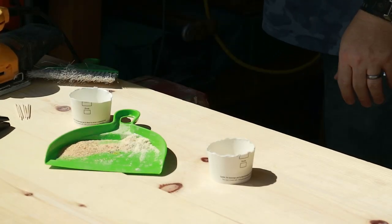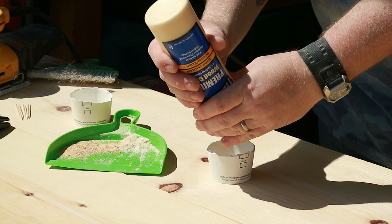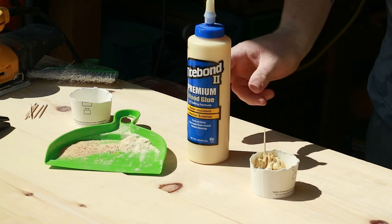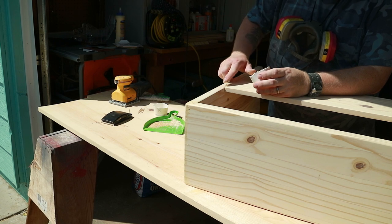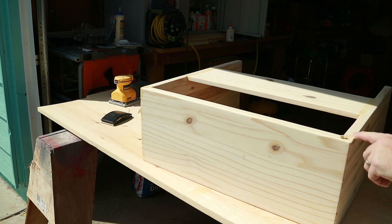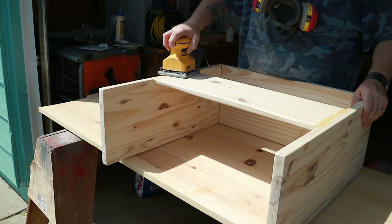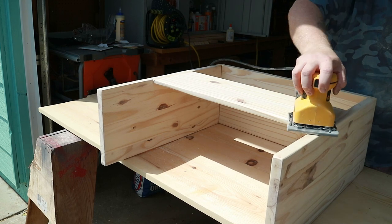The next day it was all dry and my next step is to fill in the cracks in the glue joints. I mixed up some wood filler using glue and sawdust from my sander — some fine sawdust in the bottom of a cup with just enough glue until it felt right. It's kind of like biscuit dough but this stuff would really stick to your ribs. I set about smearing this doughy mixture into the cracks, really squeezing it in there and using my finger to smooth it out. Then the sanding really started — I began with 60 grit to knock off the excess wood filler and smooth down any joints, then moved up to 150 grit and finally 220 grit.